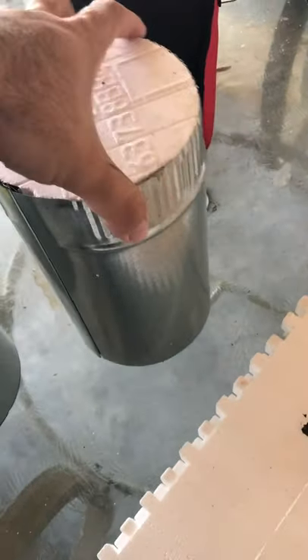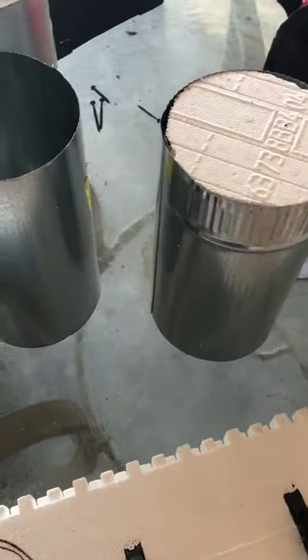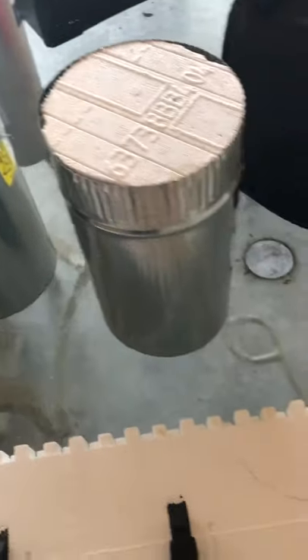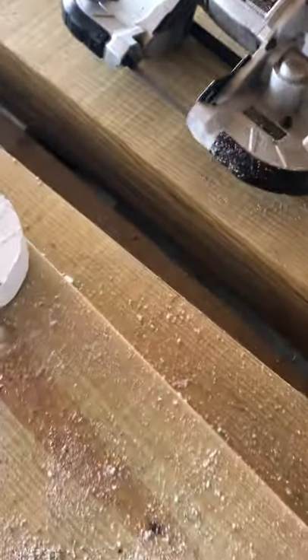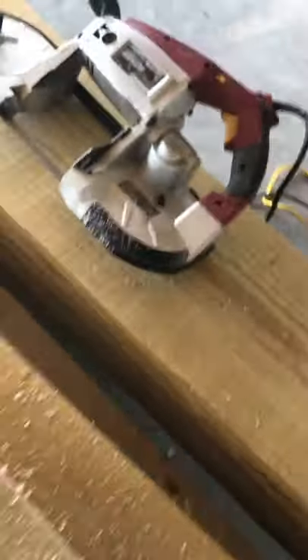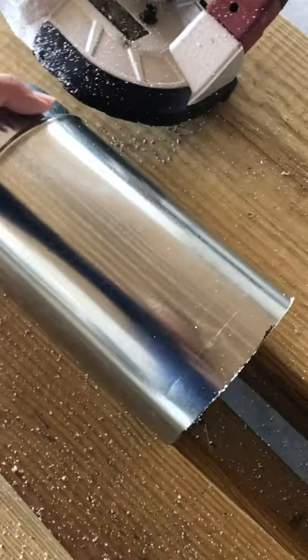With Build Block it's 11 inches thick, so I cut this to length. I actually snapped it together first — you can keep it unsnapped and cut it with tin snips, which is how it's usually done. I used a Harbor Freight port-a-band, which is actually a very good tool. I wedged it between two pieces of wood right over here, put my line drawn on it, and just cut it in little sections at a time.